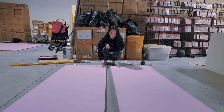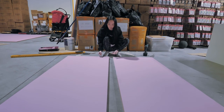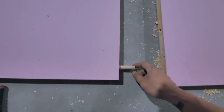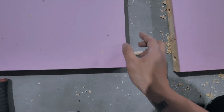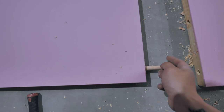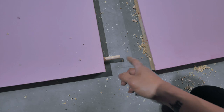What I realized with the door is, if you drill it too much, it just keeps going. So if the hole is too big, this dowel can just fully go through. That was the main problem we've had the last 2 hours. Like what Philly was saying, this literally just falls right through, because these are just doors, the wood is only about this thick, and if I drill too far through and try to hammer this into here, this thing will just go right through, which is really annoying.